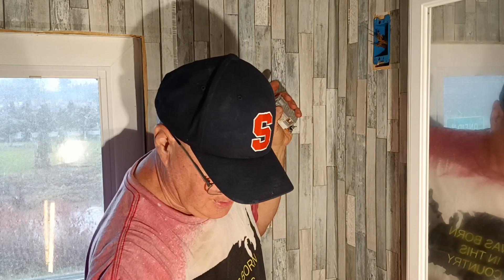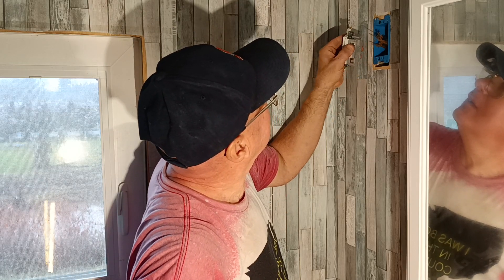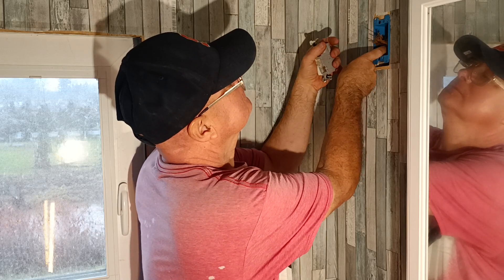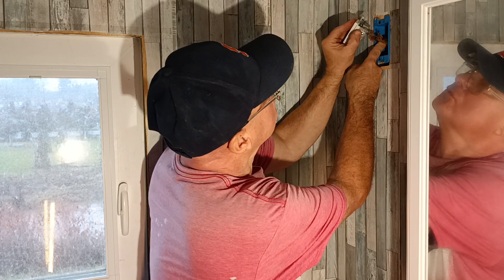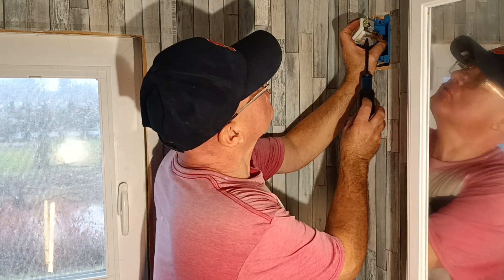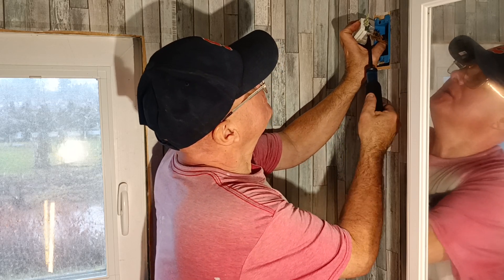White goes on the silver line screw here. The wire is not in bad shape, so we're going to put it back on the silver screw — the white side. Since there's no ground wire, this is the older two-wire wiring. But having the GFI in here takes the place of not having a ground.